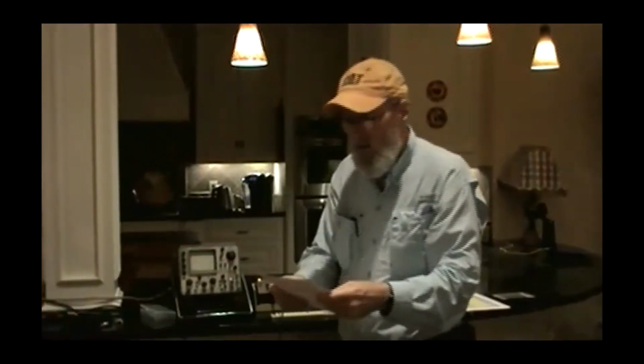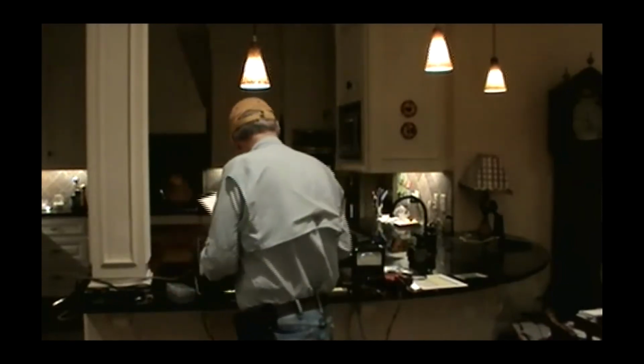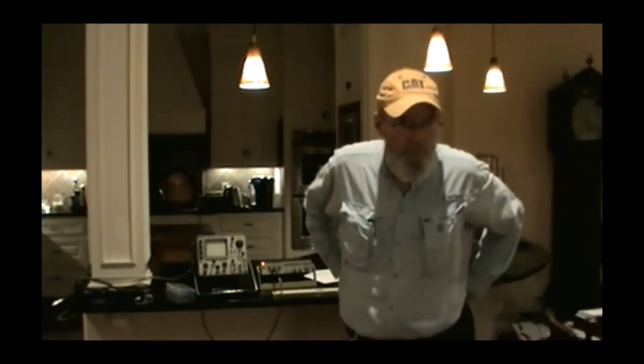Tom, while you're looking at that, let me just add, for those who are out there who want to own a repeater, buying the repeater is the cheapest part. Buying the duplexers, getting access to a tower, the hardline coax, and the antenna really add up. But what Tom was saying is that with a duplexer, you typically have a device that will block one range of signals while allowing only another. And that's why the 2-port device allows you to measure both simultaneously, because if you do them separately, you can't get them in sync. Is that a fair rendition, Tom?